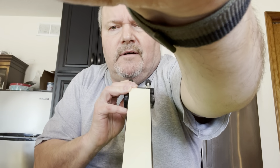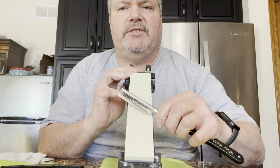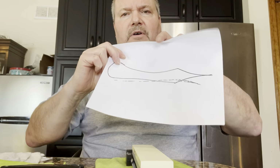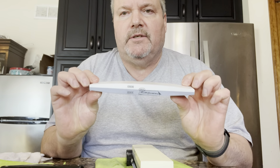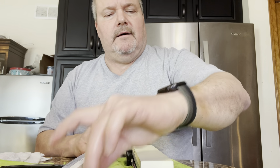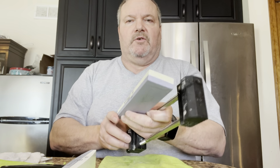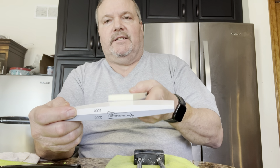But along the lines of that, when you have an ellipse, one of the things about an ellipse is that by angling the razor, you're changing the radius of the stone that is applied to what area. And since this stone is shaped, okay, on the same shaping plate as this, by taking the tool that I'm trying to sharpen, and as I move this way, I'm moving from this longer curvature, which you almost cannot really see, but it's there, to something like this, okay, because this matches this.